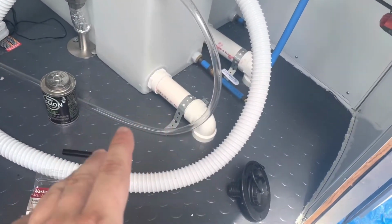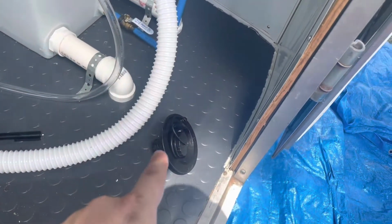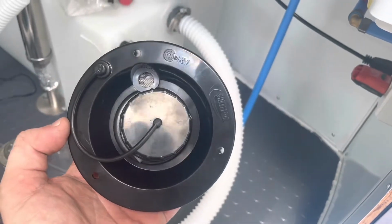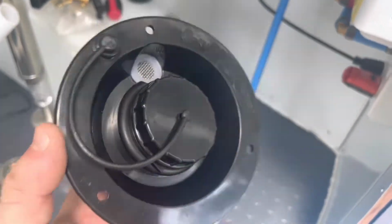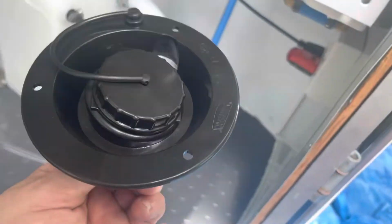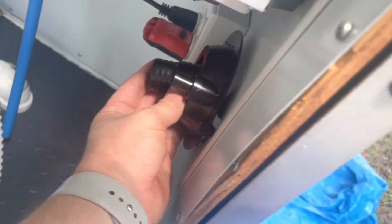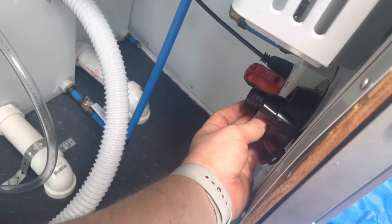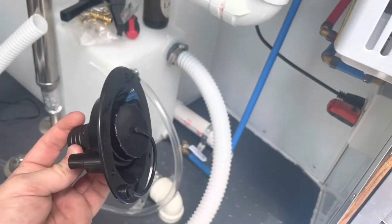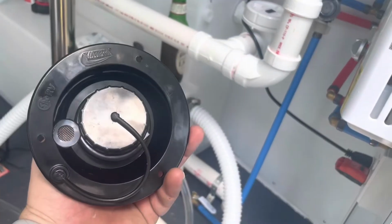So last thing for us to really complete today is going to be connecting the water hose and the air hose to the, I don't know what you call it, the fill cap, I guess you could say. This I bought from Amazon, made by Valterra. I will leave a link in the description. I got it in black because my trailer is black, but you can get them in white as well. This is basically going to be gravity fed, so we're going to have it right around here. We'll drill the hole on the outside, and we have a downhill flow from there into the freshwater tank. So that's really going to be the last part of the plumbing until we get into the propane. So let's go ahead and get this done.